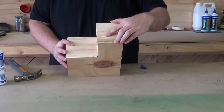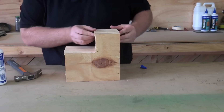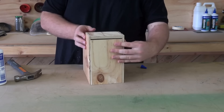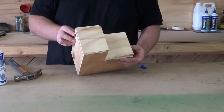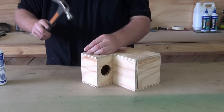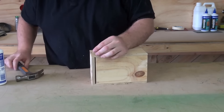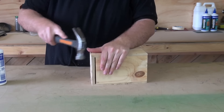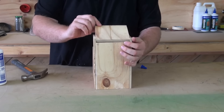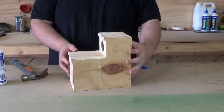The other one will go in the top here. This one should sit on the front there, but have a small gap along the back. Again, just drive a 25mm nail in, turn it over, put the other one in, then test that it opens. That gap there is just so when the lid opens, it doesn't get hooked. And there it is.